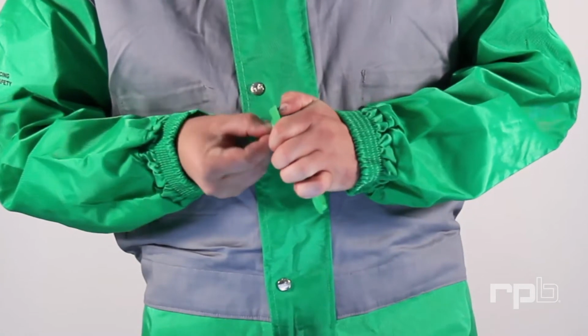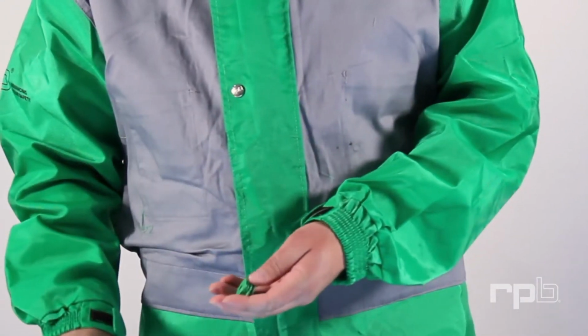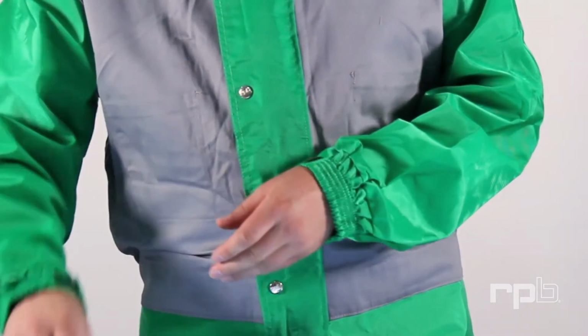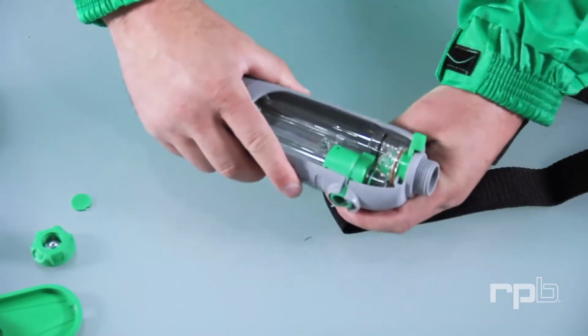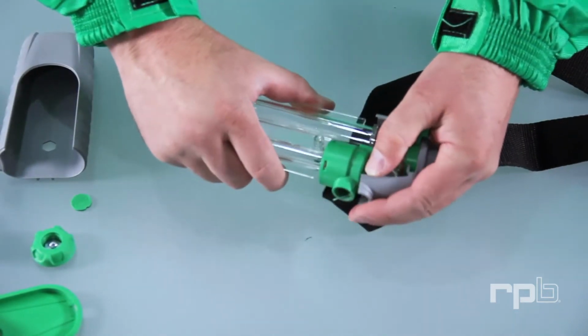While pressing down firmly on the exhaust case, turn the flow valve clockwise and remove it, taking care that the small center O-rings stay in place. Lift the belt loop over the bottom case to allow it to slide down off the U-tube. Remove the U-tube from the top case.